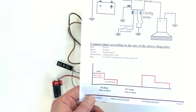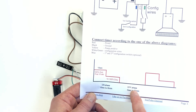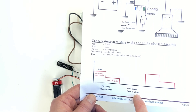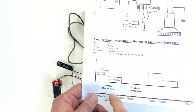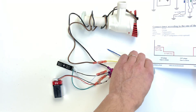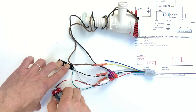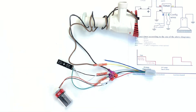You can run the pump at 25% or 50% depending on your pump. There is also an optional off phase — you can run the pump for 30 seconds, shut it off for three minutes, then run for 30 seconds again, or configure the pump to run at a lower duty cycle all the time without an off phase. To configure the pump, you push two buttons before supplying power, supply the power, the pump turns on, then you release the buttons and the timer enters programming mode — your previous configuration is wiped.